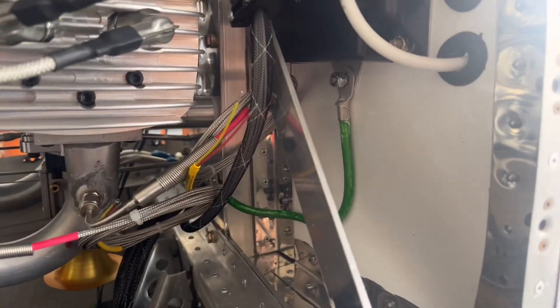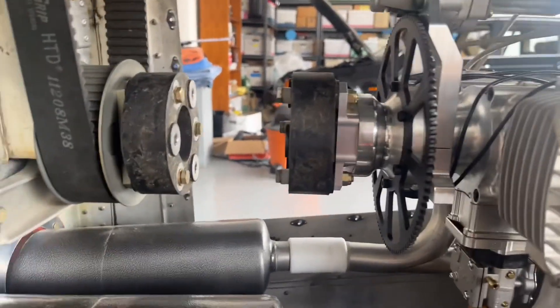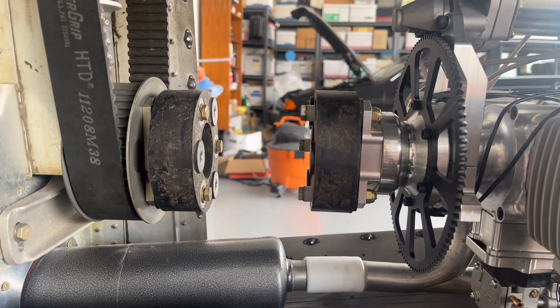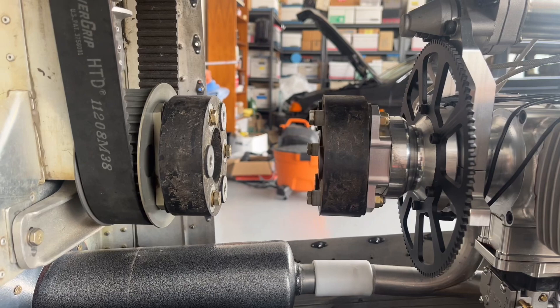So I'm going to have to pull those bottom adjusters back out and shave a little bit off of them to bring this into correct position. But the lateral position looks really good. It looks like I'm dealing with about a 3 and 3/16-inch-long jackshaft, which I now can have made since I know the dimensions, and it can work.